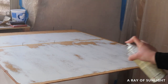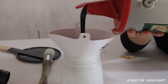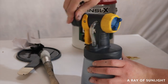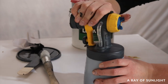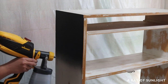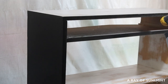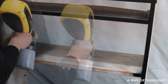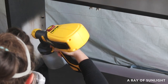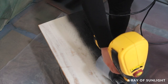Then I did another step that most of you will probably roll your eyes at — I primed with a black primer called Aqualock. I thinned it out so I could spray it on with my sprayer and have no texture. So why did I prime with two different primers? The cabinet was really spotty — some parts had paint, some was down to bare wood. When you paint over spotty surfaces, you'll see the difference between raw wood and painted areas. The Aqualock primer covered a lot of that up, but clear shellac doesn't really help with coverage. And Aqualock does not provide true stain-blocking power like shellac does.